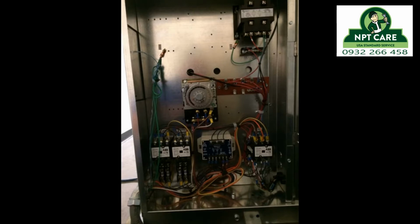Now, the defrost termination switch, if that coil gets too hot, will actually engage a little solenoid in the time clock itself, manually tripping it out of defrost. If for any reason that sticks, there's also a secondary safety that works off of temperature that kills power to my heaters itself. So if the defrost termination doesn't trigger, the defrost heater limit switch will just shut the heaters down. And that's kind of how that works.